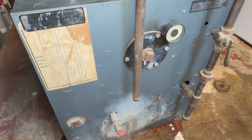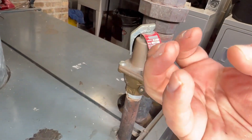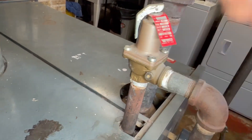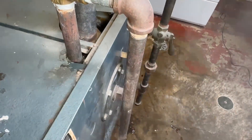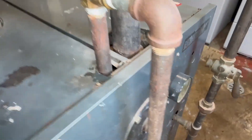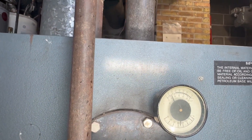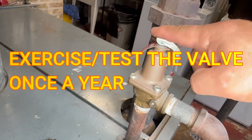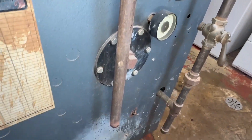This valve on this boiler is constantly leaking. I tried to reset it a few times — sometimes there's debris in the diaphragm. Inside there's a spring and a diaphragm that opens when it reaches pressure; it's spring loaded. I'm going to pull it so water comes out — of course you have to be careful, that's scorching hot water. This one is 180 degrees because it's a boiler. Can you see the pressure? It's 178 degrees. After you exercise the valve, just tap it lightly so it seats properly, but this one is beyond tapping because it's been leaking for two days.